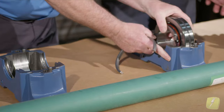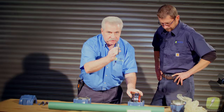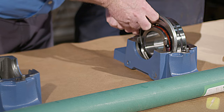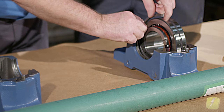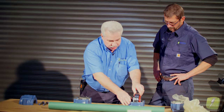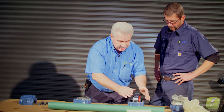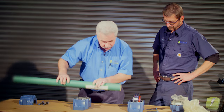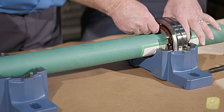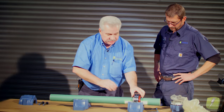And if you'll notice, we can move this bearing now almost the exact width of this fixing ring. So if we install the fixing ring in the unit like so, that took out all the play in this bearing. So right now if we were to lock the bearing onto the shaft — this being the shaft — we secure the bearing with the race on the inner race. This would now be the clamped end.